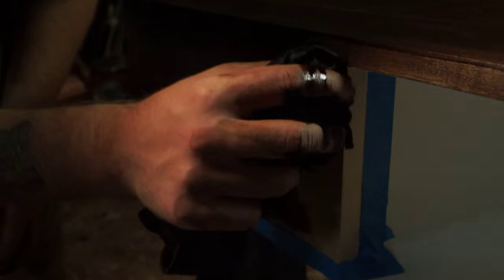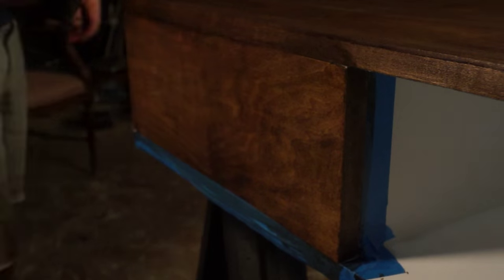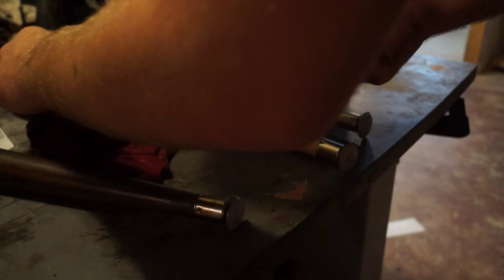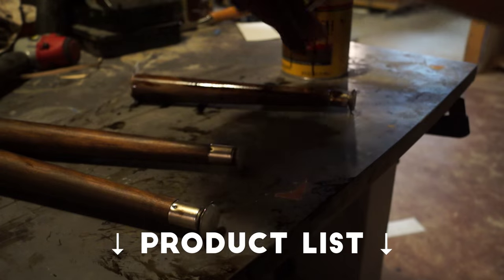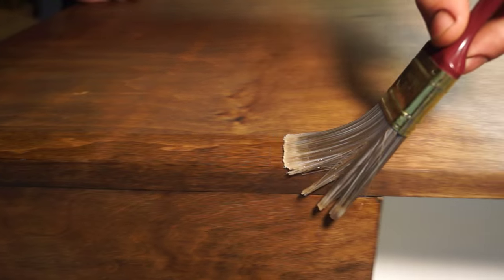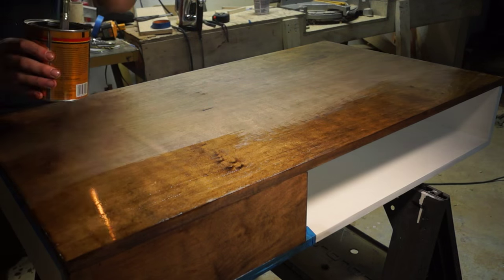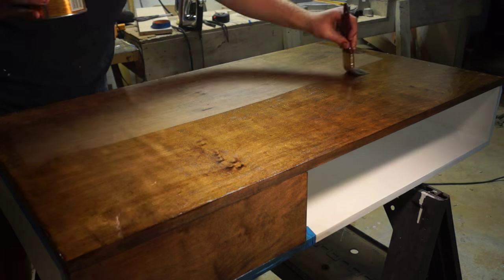Here's a good visual aid of why we cut those two sides shorter than the others. You can see that the back panel is actually let into the sides a little bit, which gives it a more custom look. I ordered these legs and hardware online and I'll leave a product list in the description. And finally, I could apply my clear coat — four coats of a semi-gloss polyurethane, but you could finish it in whatever you want.